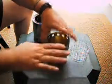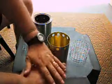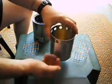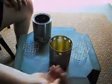And you want to lay the pieces of wood flat in the stove and build each layer interlaced and staggered like a log cabin. This will allow airflow to go into the stove and up through the stove more efficiently. Do not stack your wood vertically.